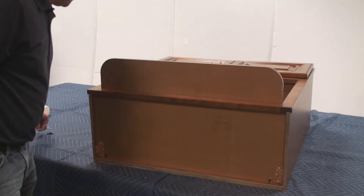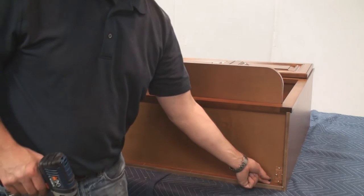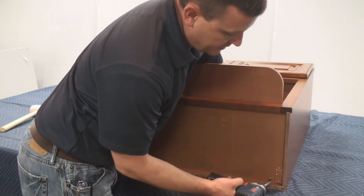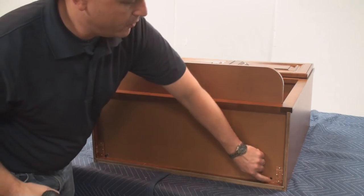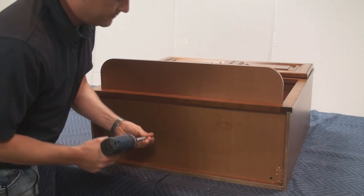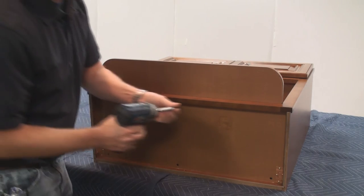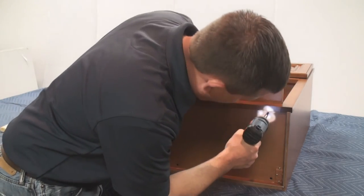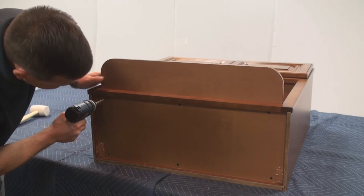For the last step of the shelf, we need to go to the top of the box. We need to add some screws to keep the shelf from cantilevering out if the microwave is a little deeper. There are no pre-set holes for these screws. Just behind the back clip near the back of the cabinet, hold down the shelf from the inside. Let that pull up nice and snug on either side, one in the center, then repeat that across the front. All you are trying to do is pull them snug — not really any need to recess the screw. They are nice and hidden behind the inside.